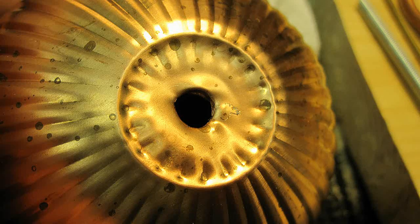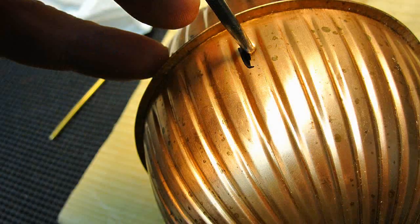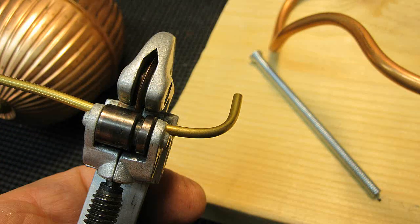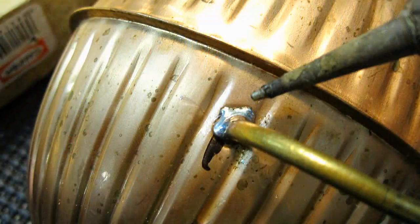Next, you'd need to drill a one-quarter inch hole on the other side, being very careful not to bend or make this hole too big or the steam will leak out too much there. With an eighth-inch scribe, you can punch just the right size holes for the brass tubing jets. To bend brass tubing, just use a spring over the tube and bend — it keeps it from getting kinks and you make a nice smooth bend. Put the jets into the holes so they oppose each other and blow the same direction. You can use amazing goop, solder, or epoxy to place these tubes in.